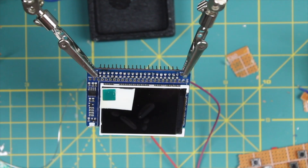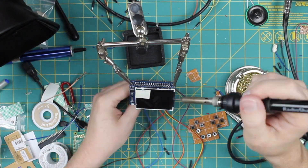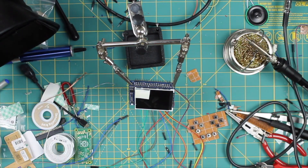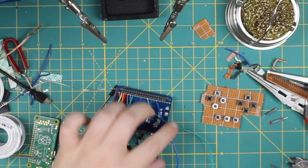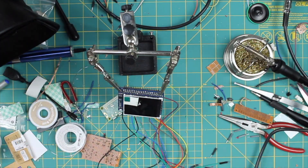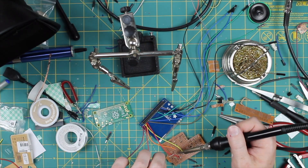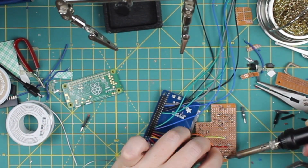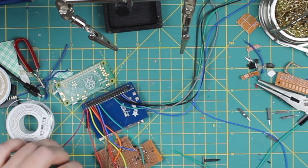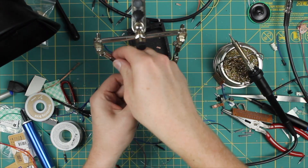The Pi TFT HAT comes with a separate GPIO breakout below the 40-pin connector so you can easily attach control wires — this is how I'm going to connect the buttons, using Adafruit's default layout for their retrogame script. After a quick orientation check, let's get these wires soldered to their corresponding buttons. Now, moment of truth — it's time to solder the Pi to the screen module with all the wires sandwiched in between.